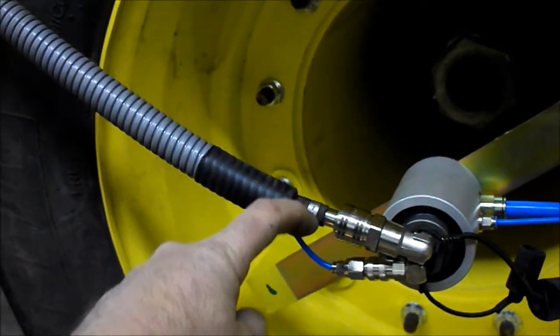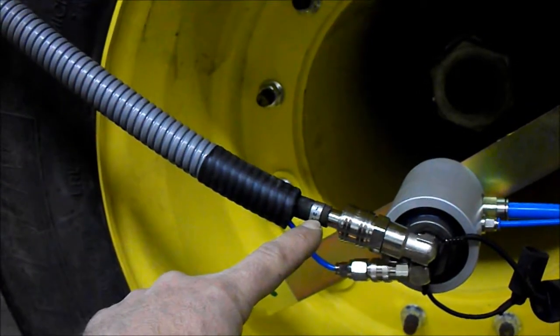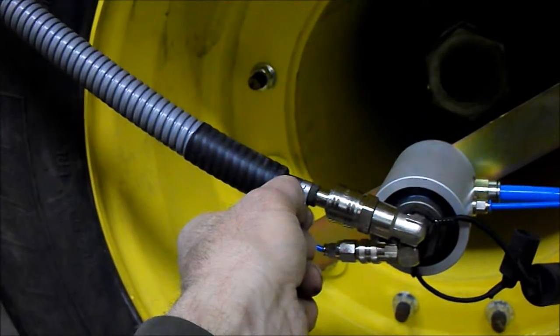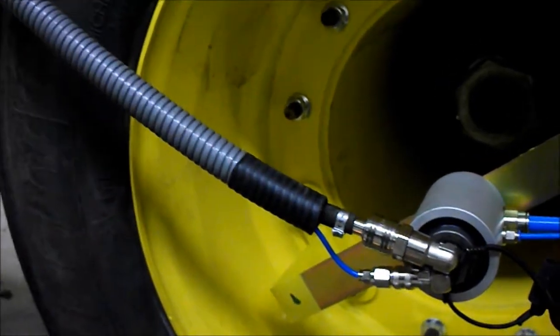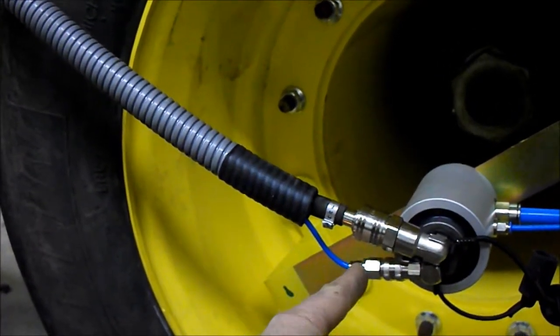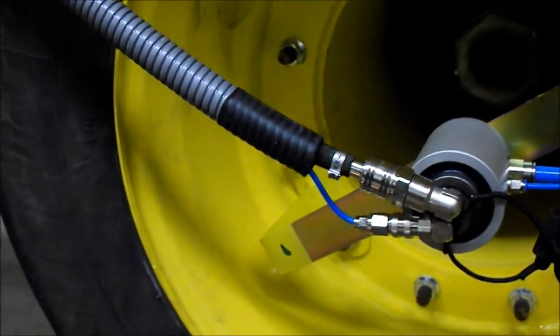There's crimp hose clamps here and screw type hose clamps. Either one will work. Slide your black hose on, tighten it down with a pair of side cutters or end nippers. The 4mm airline, fish it through till it's snug, because at this point your extra is down here, and cut it clear and insert it in there fully so it doesn't leak.